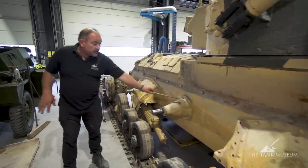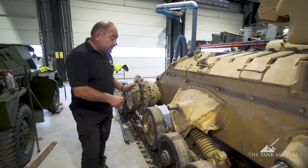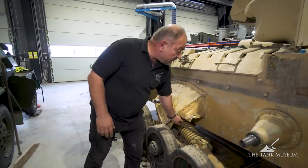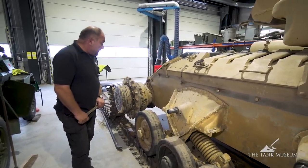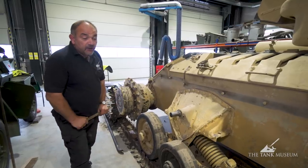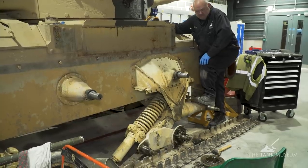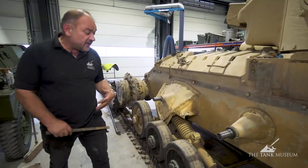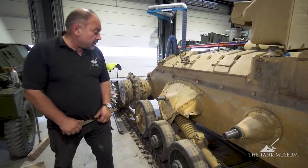Coming back slightly, you can see the central top roller and another suspension unit at the back, made up of the spring to absorb shock. The bump pads will probably need replacing as well. Most of the bearings — sometimes people see the grease nipples and assume grease goes in there, but on a lot of these old tanks it's actually oil. If grease is put in, it gums up all the oil ways and can cause more harm than good.